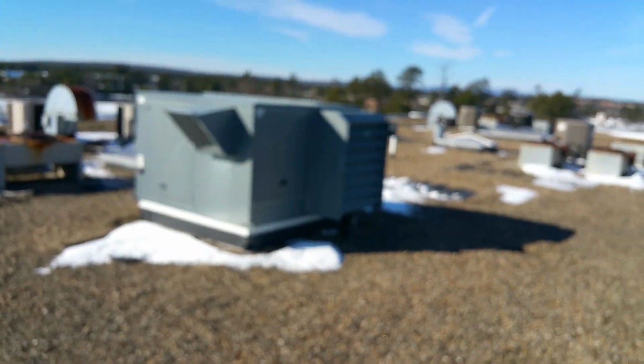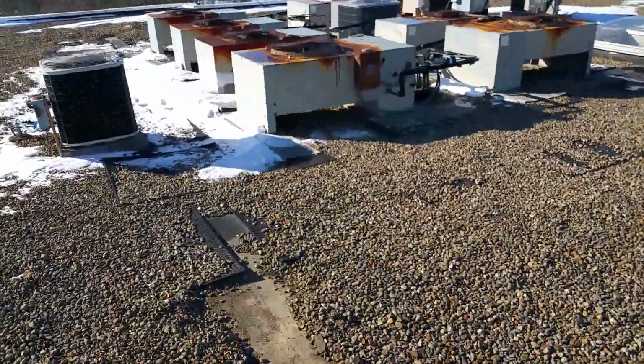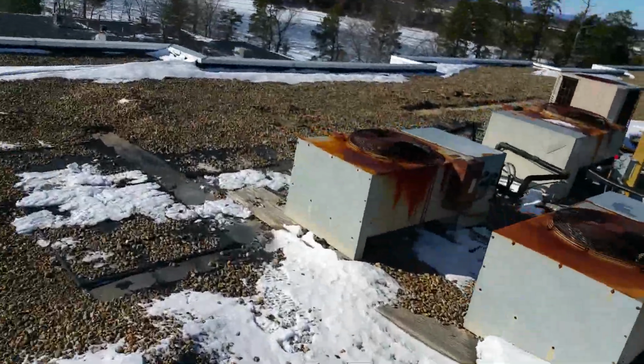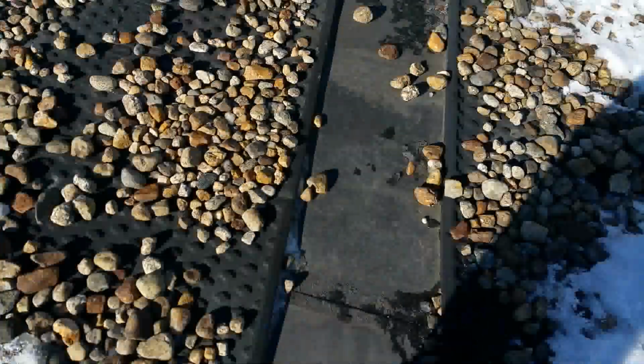So in terms of repairs on this roof, the main areas of concern are going to be around all of your penetrations, along your flashings on the edge of the roof, and the seams, because everywhere that we've looked on this roof, the field of the roof is actually in very good shape considering the age, and we believe it will last for many years to come.